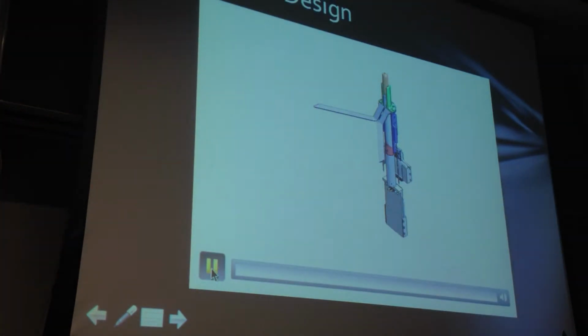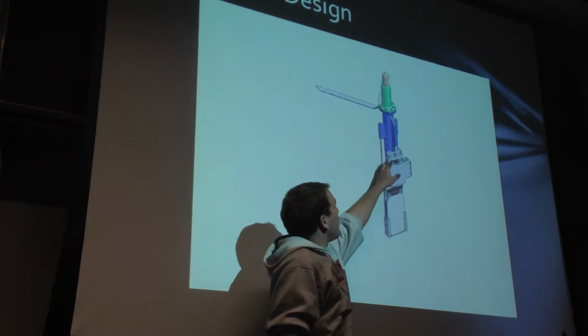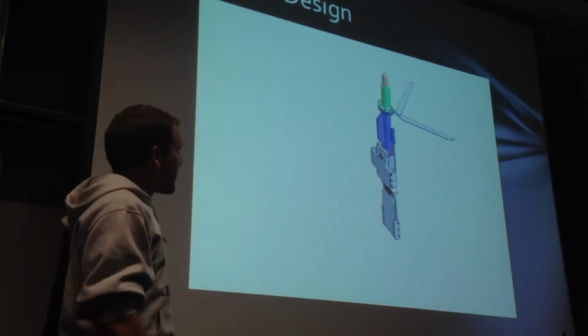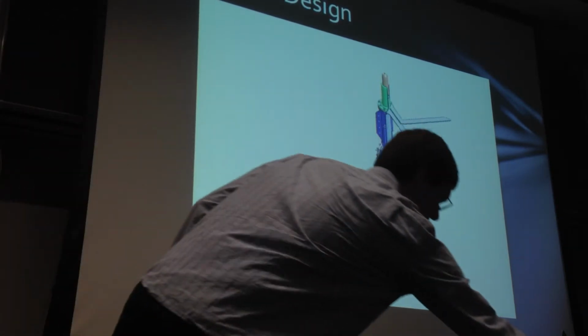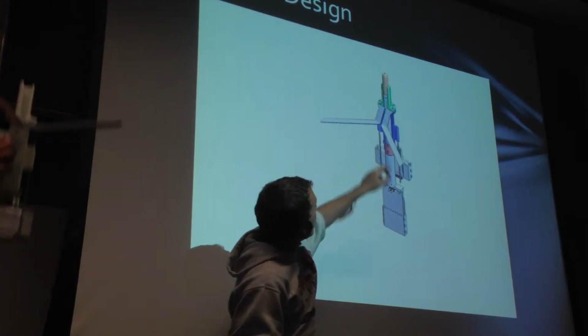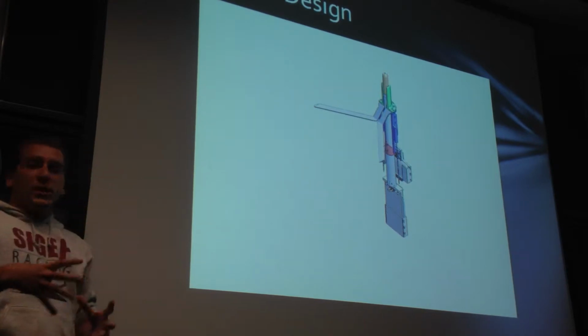What you can see here is this horizontal plate, the blue, the green, and the triangular arms, which are all attached to the rover as the passive capture mechanism. And then this vertical induction pad and this center cylinder with the orange top is the part connected to the tether that would be actuated up to connect to the rover.